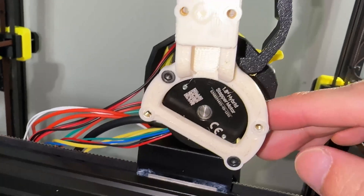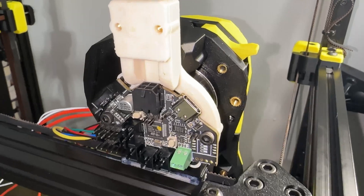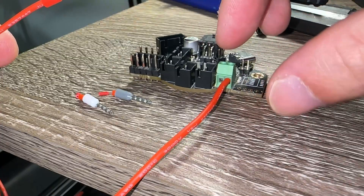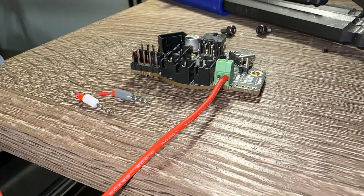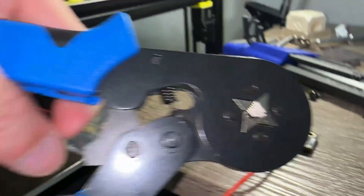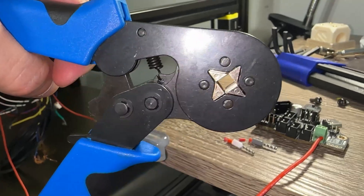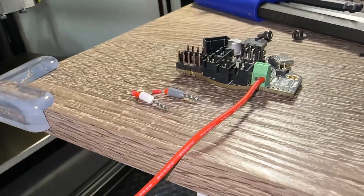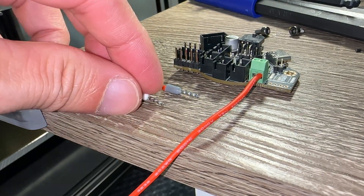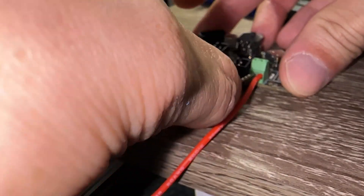The mount also uses M3x8 screws. This is just a mock setup so I could trim the wiring for later. You see these screw terminal connectors — time for more crimping. If you just insert bare wires, frayed strands may short out against the neighboring terminal. This is a ferrule crimper. I bought the blue version because it costs $1 more than orange but supports a wider range of wire sizes. These connections are known to be very strong. However, these terminals are so tiny that even my smallest 22 gauge barrel won't fit, so I will have to save this for later on the controller board.